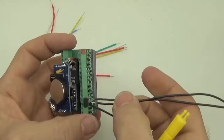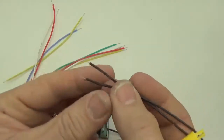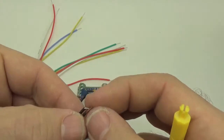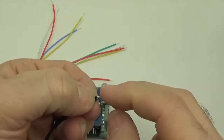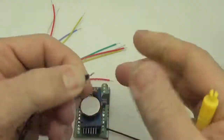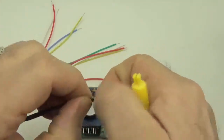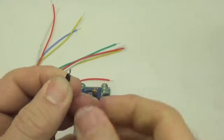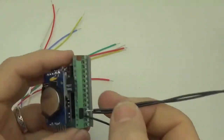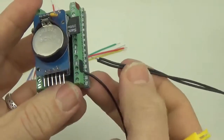And if you look at places like NASA, they're very specific about requiring non-tinned wires in a lot of their connection situations. So they want you to not use tinned wires. So no, when you're using screw terminals, try and keep the wires obviously clean, but you don't want to tin them. And the other thing to keep in mind is that you can do what I just did here.